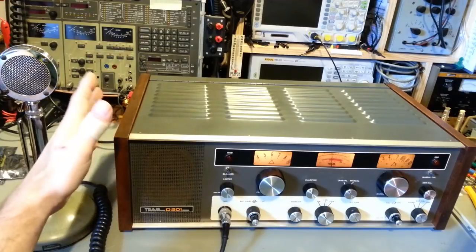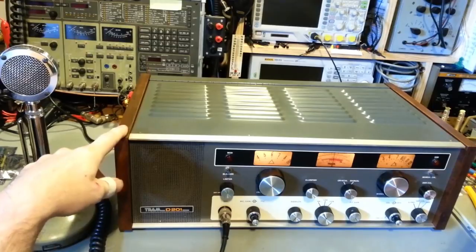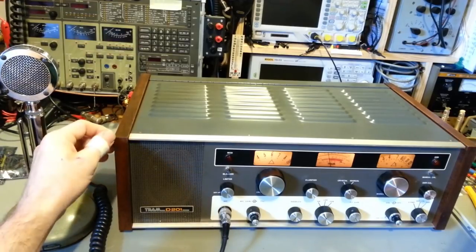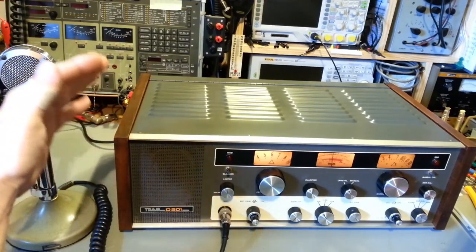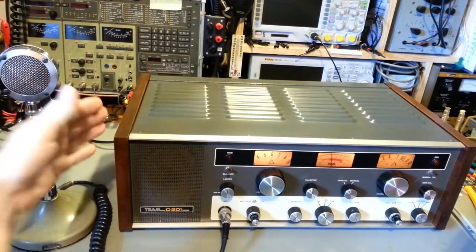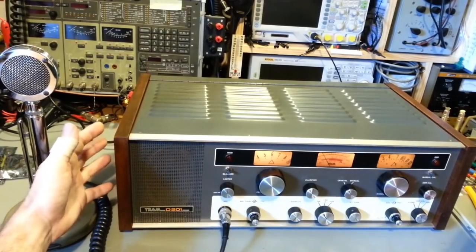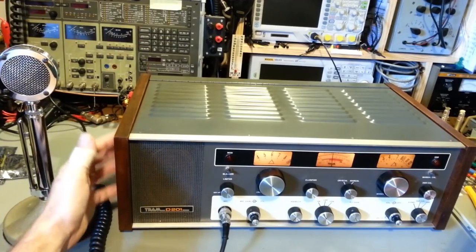Another thing, the end covers were a little bit faded. I've told you before the best way to restore a wood cover like this. Now, you can use something like Old English. A lot of people like that, and it's great for really chipped away and damaged areas to try and restain. But just to bring back some shine and darken it up a little bit, brown shoe polish works fantastic. It's wax. It's brown. Same color as the wood. Does a really nice job at refreshing the covers. Because these were not protected in any way. These were just stained, and that was it. They had no actual finish on them.